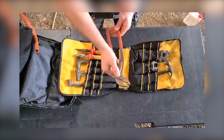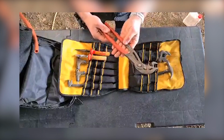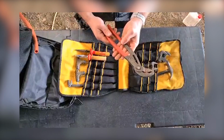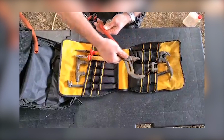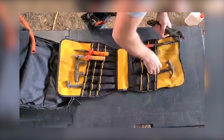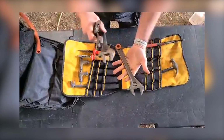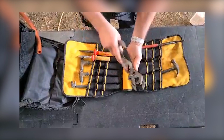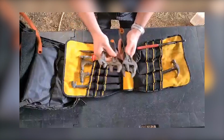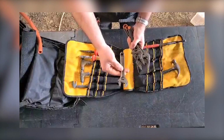Big adjustables in this bag, because we're on the maintenance side of this bit, sometimes things haven't been maintained for years, old nuts, bolts, pumps, spanners, anything. I think they're the 300mm long ones, they give a bit more leverage in our jobs. Heavy spanner here, leverage on the 250mm spanner, the wider jaw going to 28mm. Use your go-to spanner, that one, but there's not much leverage because it's small, that's just for little nuts and drain offs and stuff.